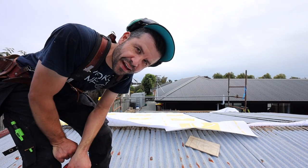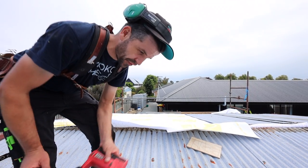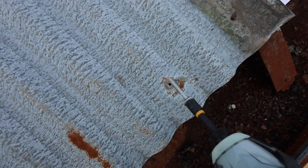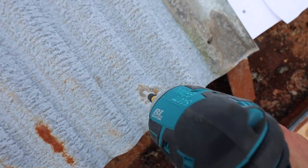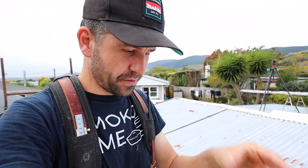Underlay is down — let's put the roofing on before this rain arrives. If you ever do this job and you're pulling old nails out or old screws out, make sure the new screws you replace them with are thicker in diameter. That way you're not going to get a leak in the hole because all you're doing is making the hole a little bit bigger for the new screws. If you use a screw the same diameter as the nails you pulled out, there's a higher chance it'll leak. Also be careful not to over-tighten the rubber washers — you can easily split them or spread them out and then they won't seal the joint.